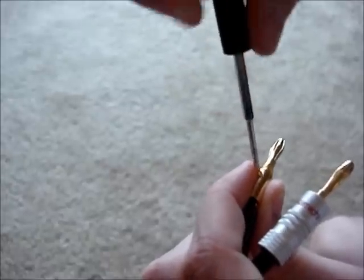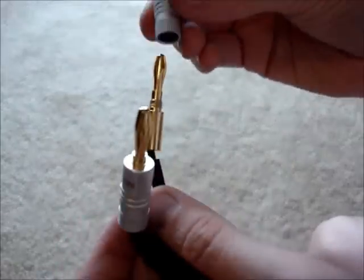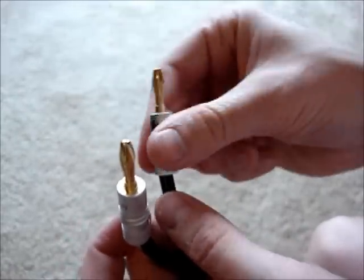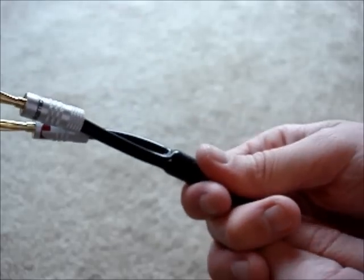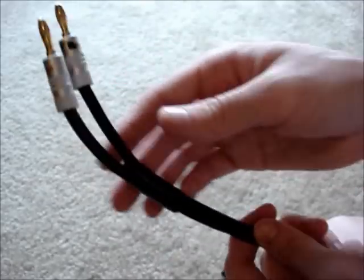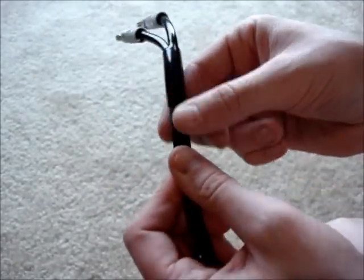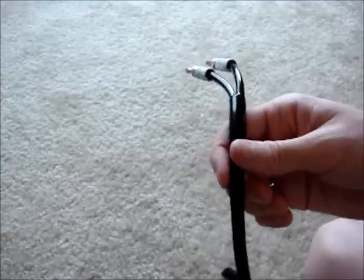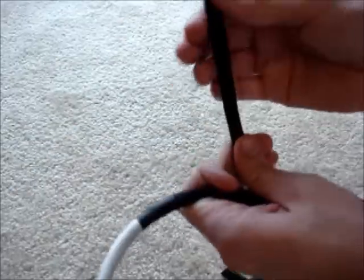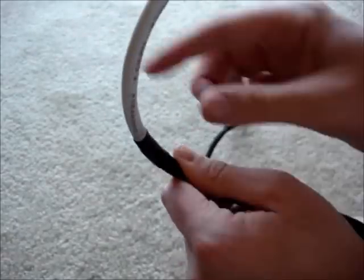Then put the housing on top. Make sure if you're using the red wire you have the red connector, then simply tighten it down — it completely covers up the gap. Repeat the same steps for the black connector with the black housing. Push the cable pants up as far as they go for a nice snug fit. Some people like to put a little piece of heat shrink where the cable pants end — do that before finishing the second side by slipping both pieces of heat shrink on first.